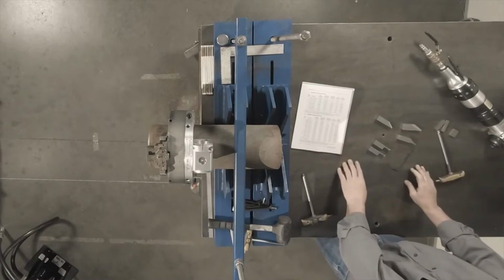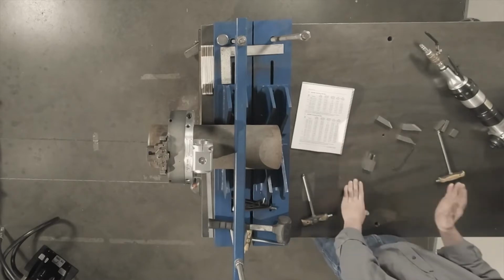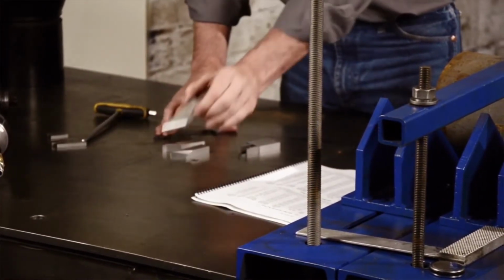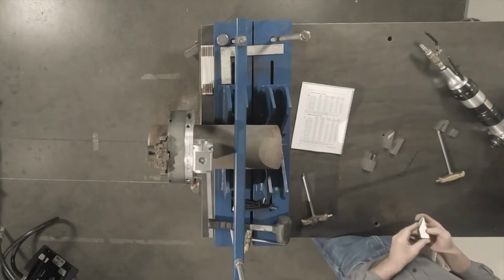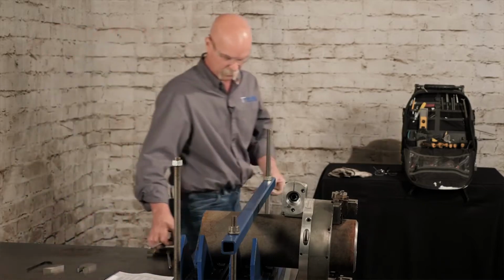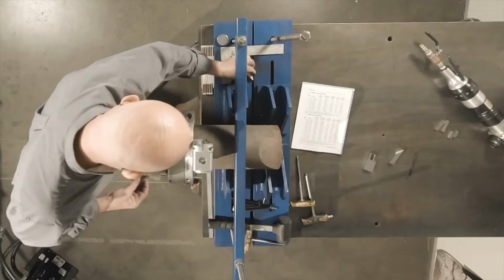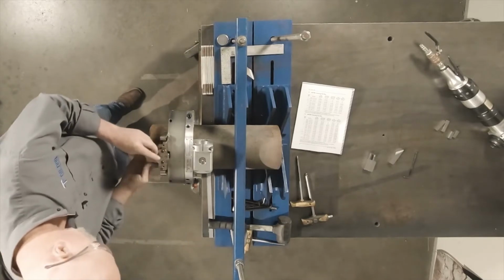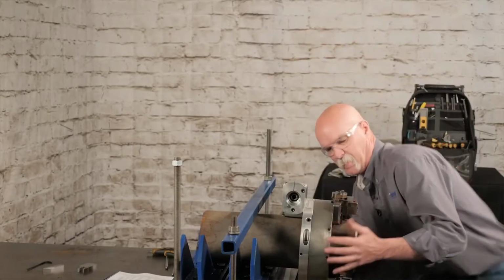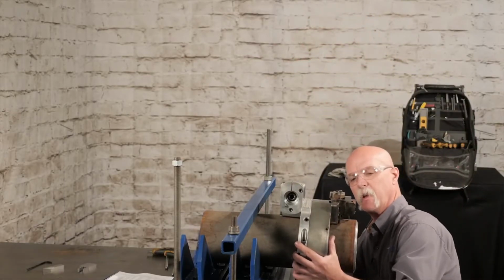So looking at some of our tooling, we have a straight sever set where you could just cut it off. We have a sever bevel in a 3/4 size, but we also have a 37.5 or whatever bevel you're going to do, and a 1-inch so you could do heavier wall. The benefit also with having the 3/4 inch ones, you can use spacers and shim them back and forth to get right on your punch mark. Setting the tooling on the end of pipe punch mark.